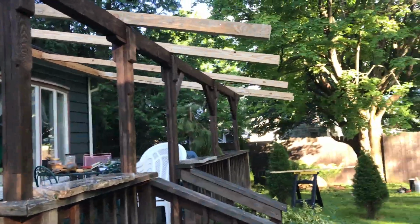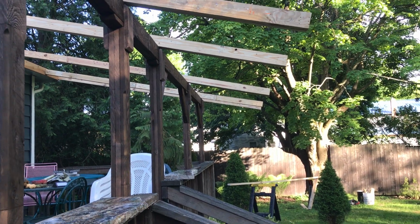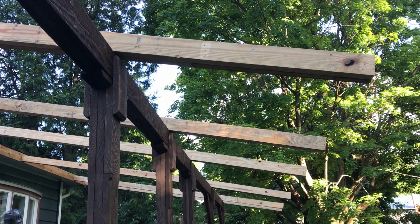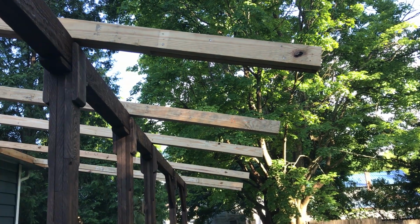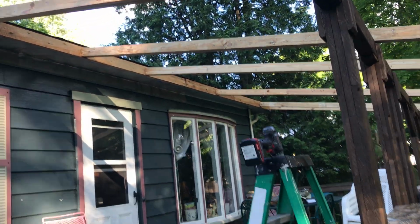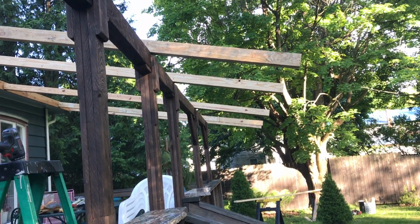when I went from the first one over there, it was 39.5 out to the tail. Well, the further over I came, I just couldn't get it to 39.5. And by the time I'm over to here, I lost 1.25 inches. So now we're at a little less than 38.5. So either the deck is not totally parallel with the house, or at least parallel with the eaves. So we're a little off, but it's 1.25 inches over